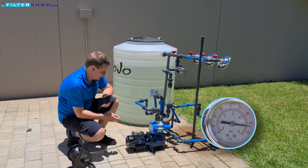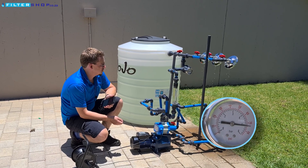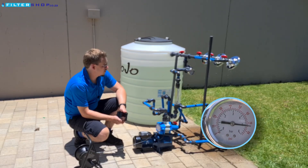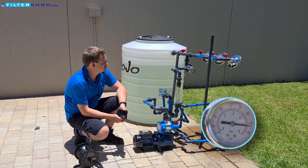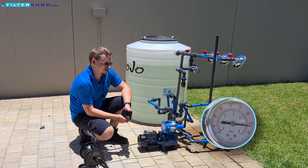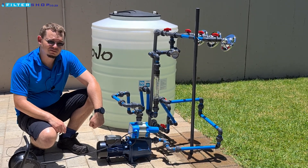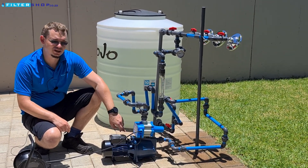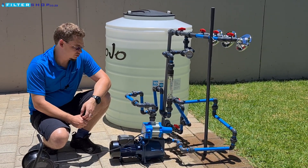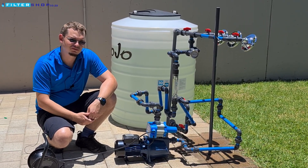Overall, a nice little pump. It's quite good static pressure and good pressure for a single shower. Two showers are still more than sufficient pressure. With three showers you'll start noticing the drop, so you might want something slightly larger. The only other thing with this 10HM pump is it has a cast iron head, so if you have corrosive water it's a little risky — if the coating goes on the inside, the pump may start to corrode. Ideally, you want to use it with higher pH water.